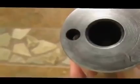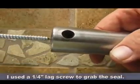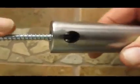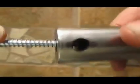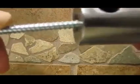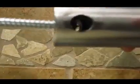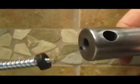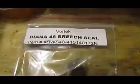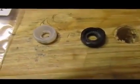I'm going to remove the breech seal out of the compression tube. Take a 1/4 inch, I just use a 6-inch long one so I can get a grip of it, 1/4 inch lag screw. Screw it in a bit. Wiggle it back and forth. There. There it is. Now I can replace it with the new one. Here's the new breech seal next to the factory breech seal that I just took out.